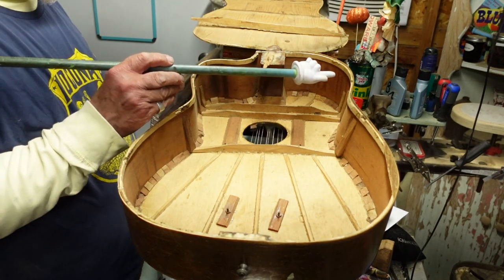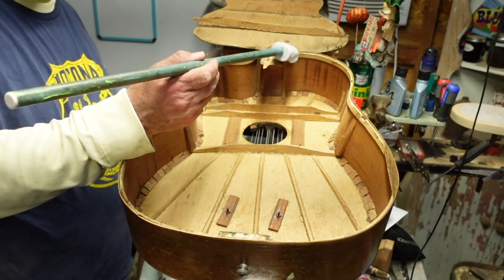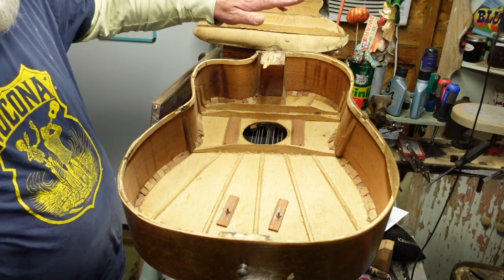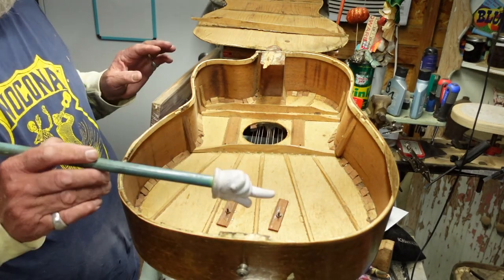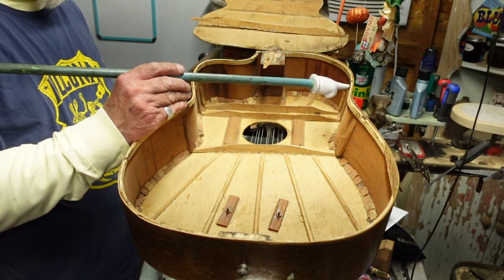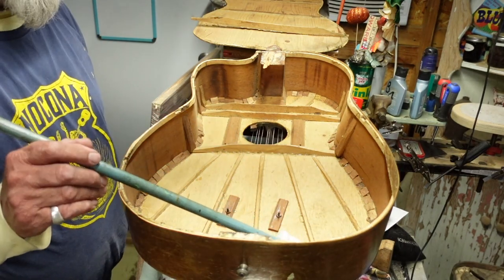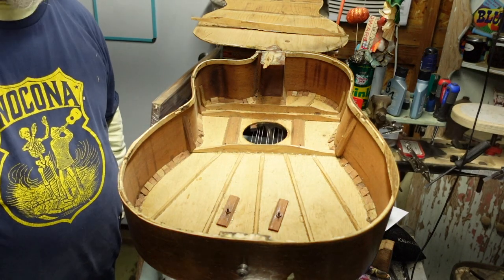I can cut a new back out of this. It's not going to affect the tonal quality - and how do I know that? Mr. Antonio de Torres actually made a guitar where the sides and back were made out of papier-mâché to prove that the soundboard on top was what really mattered. I have some kerfing coming in. We're going to trim this down, scrape this off, anything sticking up we'll trim down, get it all nice and flat. Once we get everything pulled off and things stop fighting each other, we'll get this back into shape. Then the top is going to sit on the kerfing we put right here - a whole layer of kerfing to beef this up.